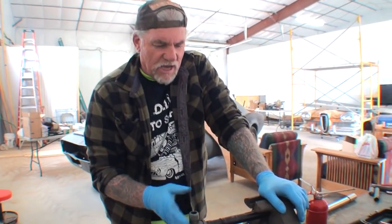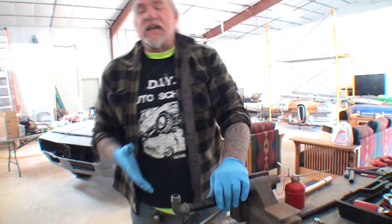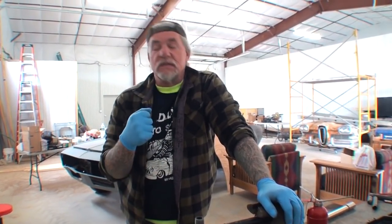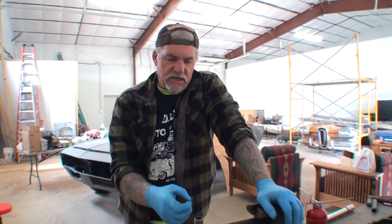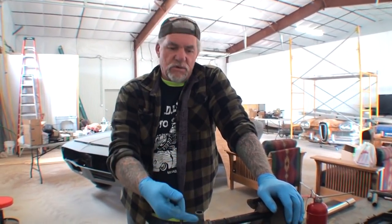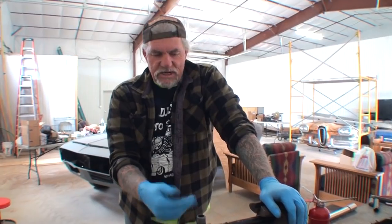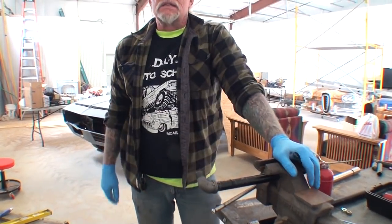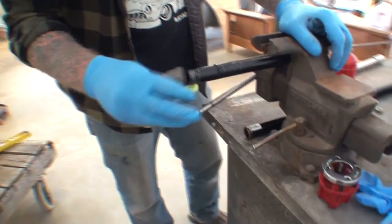And then another thing about putting pipe together, it's basically kind of like brake lines on your car. When you tighten it up, you don't want to bring it back and loosen it, because the tighter you get it, it's sealing itself. So let's say that we needed to be right here instead, but we over tighten it and then you bring it over here, it's going to have a chance of leaking somewhere. So always be careful and take your time on putting that pipe together.